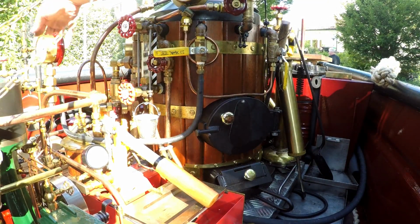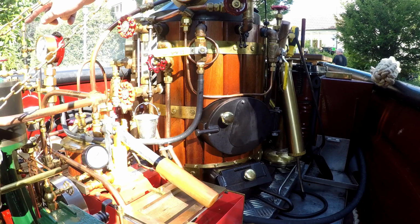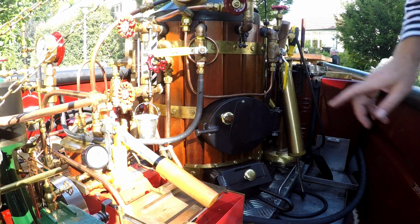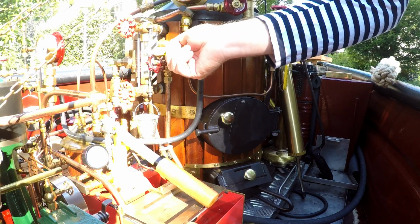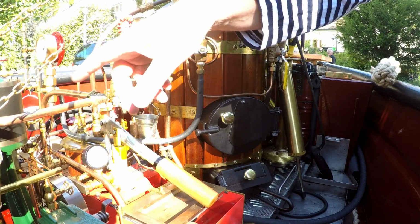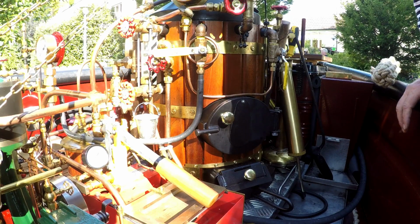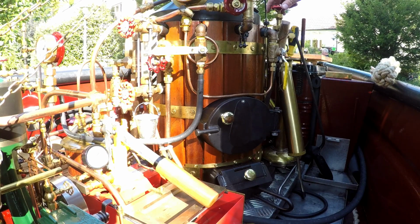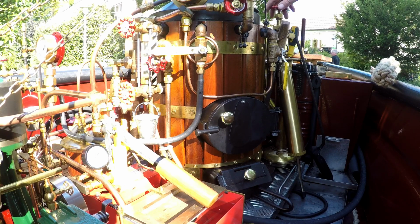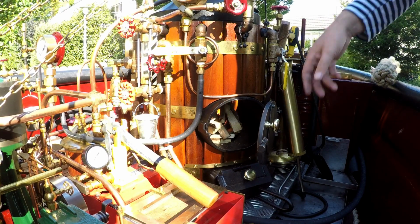Open also here the valve to see if the water is boiling. You will see then here some steam coming out. The steam valve to the machine is first closed, so as not to get the steam out too early, and later I open it to preheat the Stuart 5A and the steam pump, but first it's closed. I open the stack valve a bit to allow some air going out and to generate some draft. I leave it open at the beginning here.